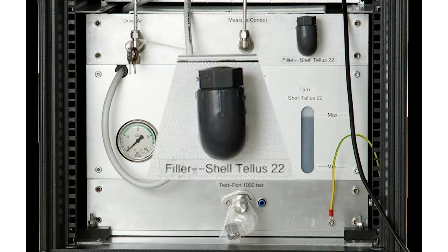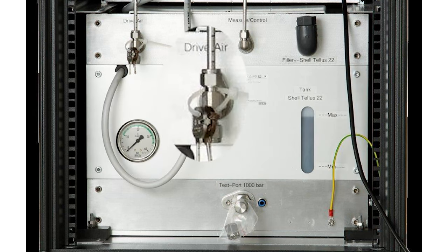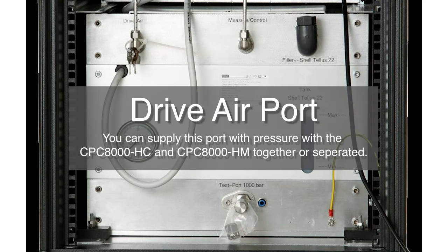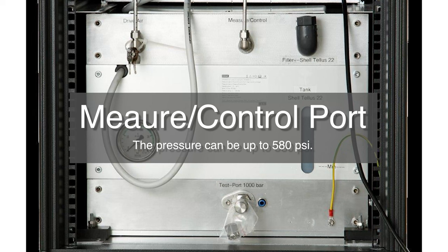Refill the tank using the filling nozzle. Do not fill more than the maximum indicated level by the window below. This interface has to be connected to the CPC-8000HC at all times — it is responsible for the transfer of data between the CPC-8000HM and the CPC-8000HC. The drive air port is used to supply the internal pneumatic controlled valves as well as the priming pump with pressure. Working pressure regulators are installed to reduce the pressure internally to the required level. You can supply this port with pressure with the CPC-8000HC and the CPC-8000HM together or separately. The CPC-8000HC measuring control port is the connection for the pneumatic control pressure from the CPC-8000HC for the multipliers; depending on the measuring range and set point, the pressure can be up to 580 psi. Connect your DUT here at the bottom.